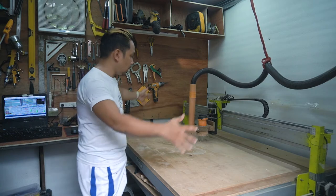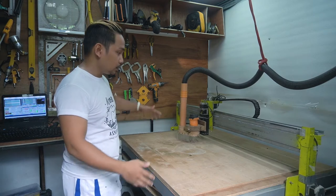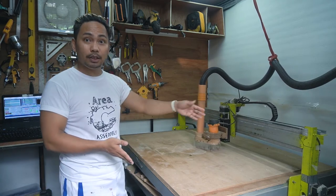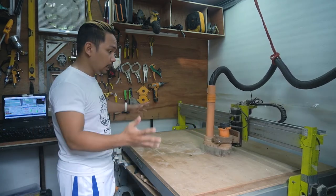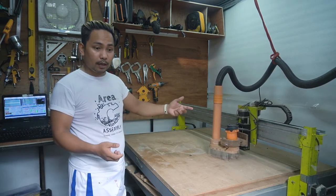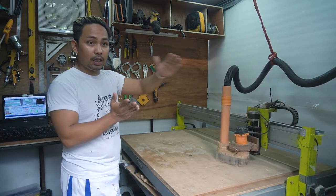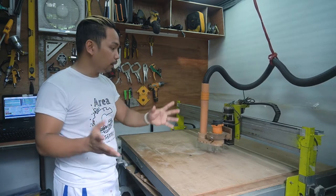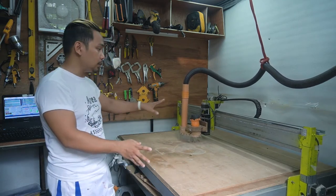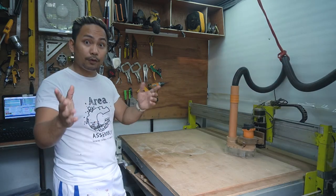The maximum capacity of this DIY CNC machine is about 1.2 meters — that's about 4 feet — and the Y-axis is 0.8 meters, almost 3 feet. The idea is that if I buy one whole sheet of plywood, I cut it into three panels, and one third of the panel is exactly the size of the machine's maximum capacity. I designed it that way.